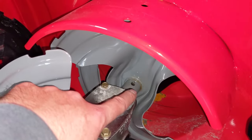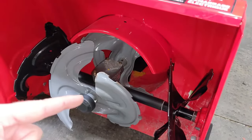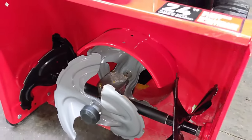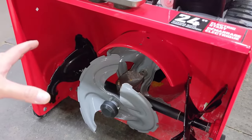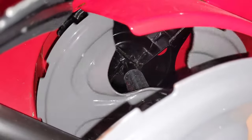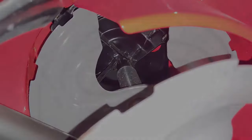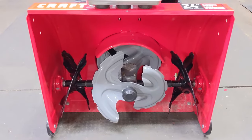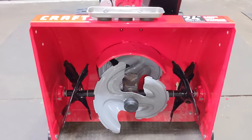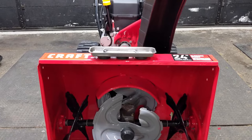We only have the first part of the third-stage accelerator fin pushing snow back. Because the second part of the third-stage accelerator shear pin has sheared, the impeller shaft is going to be spinning, but the third-stage accelerator fin is going to be stationary. All that snow coming in from the center and right side will get trapped right there. If the fin spins freely and the shaft is not spinning, that means the shear pin is broken and will have to be replaced. We've now checked the first-stage shear pins and the third-stage shear pins, and we're going to check the second-stage impeller that throws snow up the chute.